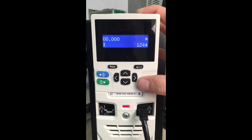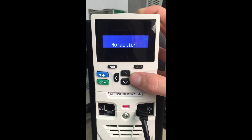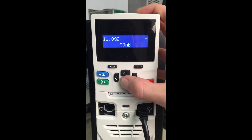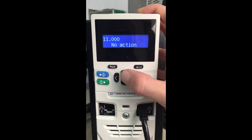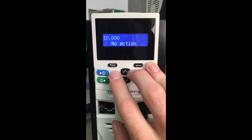This will reset our drive to U.S. defaults. Press that, reset. Now we do have a program running in our drive so we're going to come over here to 11 — this is an onboard program. So we're going to come down to 1147 and we'll return this to stop. So we always do a save in the drive.